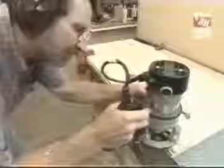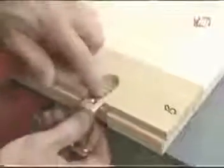Now I'm making the notch on the edge of the door. Another jig, same width of opening, but it's deeper. And now a third jig to make that rounded mortise for the leg of the hinge. Now with both doors hinged, I can now calculate my rabbet.